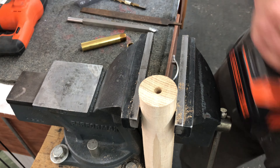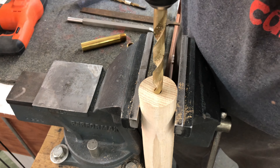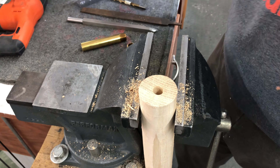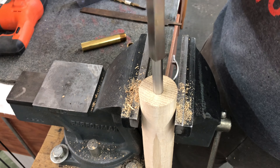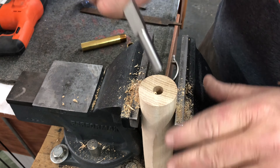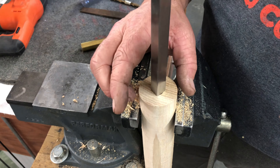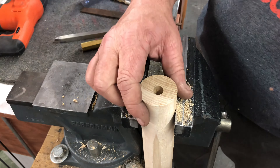Now I'm going up to the bit I wanted to use to finish off the hole. This is hickory — it's drilling really hard. I didn't put tape on the finish bit because I could feel when I hit the bottom of the pilot hole. Now a test fit — that's actually a little tighter than I'd like. So I'm going to step up to the next size drill bit. That's a much better fit, and when I epoxy this into place it'll be great. Once you drill away wood you can't put any back — this isn't like metal where you can weld a hole shut. You've got one shot at this. Now the hole is drilled and I'm going to put this back in the lathe to finish turning the handle.